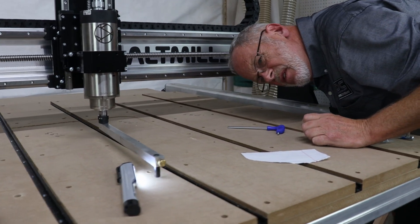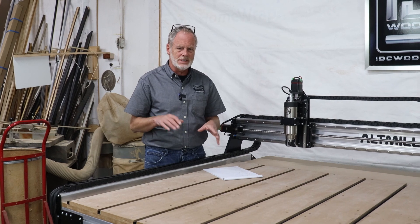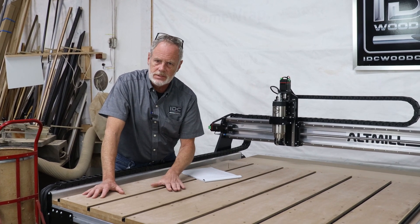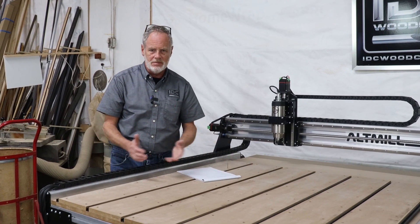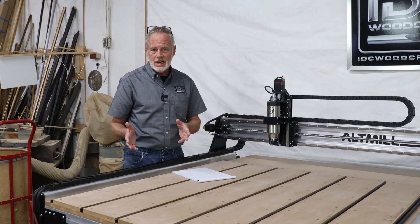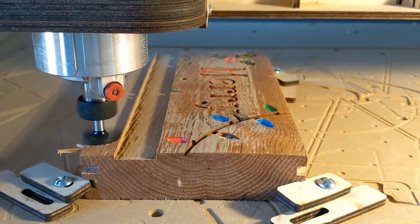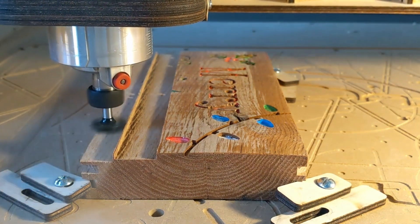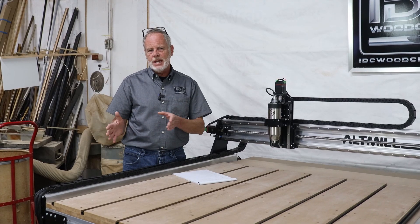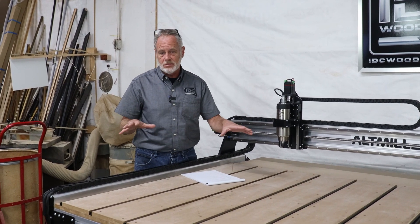Always come down to the basics: if your carve is not coming out the way you want it to and some areas are deeper than other areas, that's probably a spoil board that has lost its flatness. When you first surface your spoil board, you always have to surface it before you carve anything — this is why you need a surfacing bit like the IDC Woodcraft Ultra Smooth surfacing bit, intended for smoothing out your spoil board. Flatness is super important. After you've built your machine, leveled it, and surfaced your spoil board, there could be potential settling over a month or so, so you want to check it about a month later and you may need to resurface it just a little bit as the machine settles in.